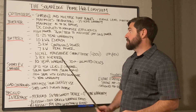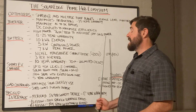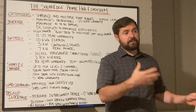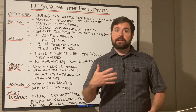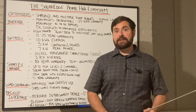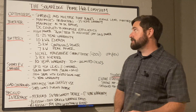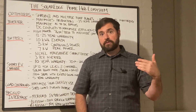The high-power inverters are the 3,800-watt and the 7,600-watt units. Those are designed to maximize off-grid power. For those who may not know solar interconnection rules — oftentimes if you have a certain service, especially in areas with combo meters like California — you're limited to the size of a solar inverter you can connect to a home's electrical system. For example, if you have a 100-amp main service panel and you don't want to upgrade your electrical service because that can be expensive, that 3,800-watt inverter is meant to max out the inverter you can put on that service.